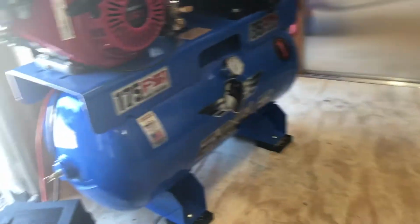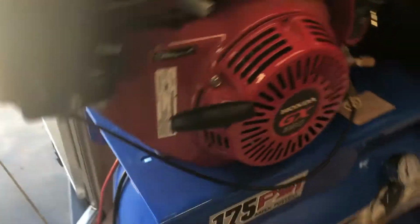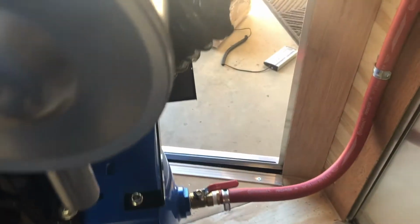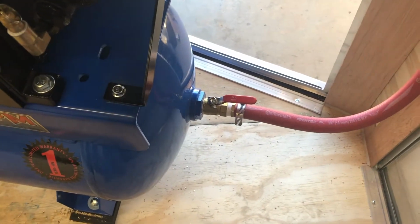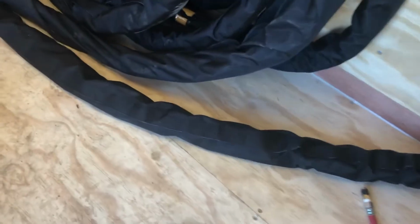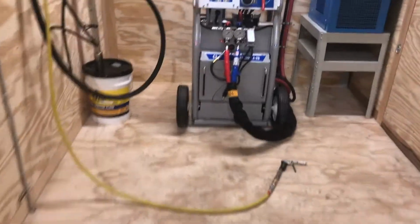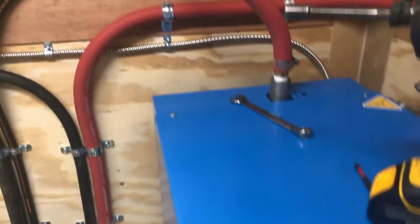All right, guys, we are full up now. We are at 170 psi. Make sure that this valve over here is open. And at the end of the day, I would recommend closing it, because if you spring a leak, let's say in this hose or anywhere in the system, the drum pumps in the back will just keep on pumping until you either run out of material in the drums or you run out of air. Shut that off for a minute, make it a little quieter.